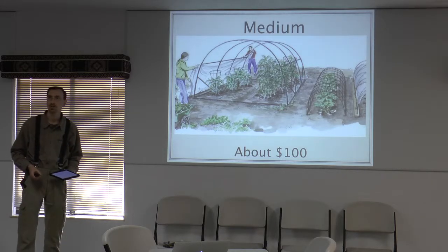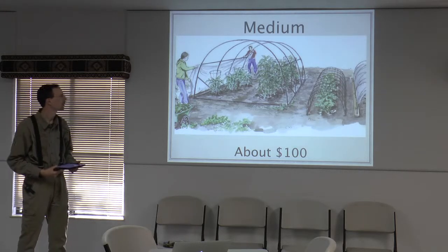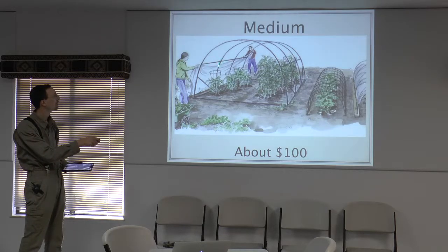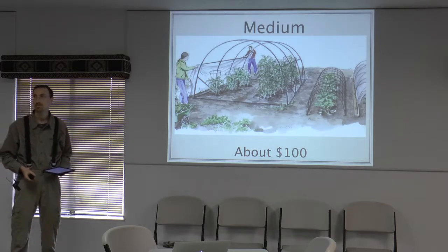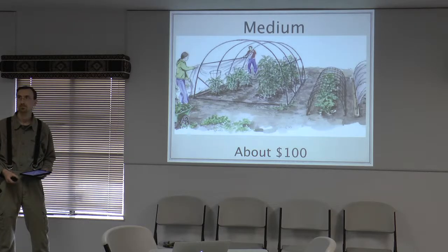This one is about a 20-foot half circle, so you get about 6 and a half feet of height in the middle and about 12 feet wide at the bottom. It's put together with PVC pipe and different fittings — corner pieces and T's for connecting in the middle, cross pieces and corner pieces along the bottom and sides, with diagonals as well. You can also use those cross pieces for drip irrigation, pumping water through the piping to irrigate your greenhouse.